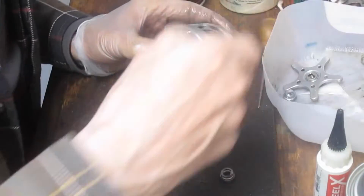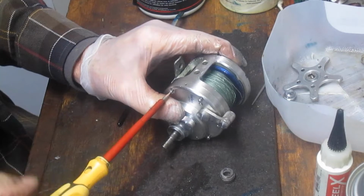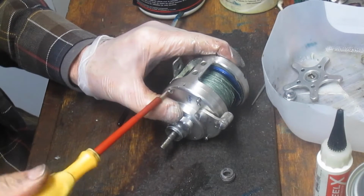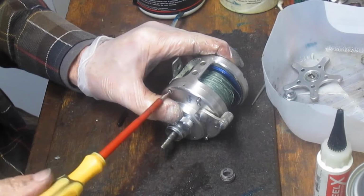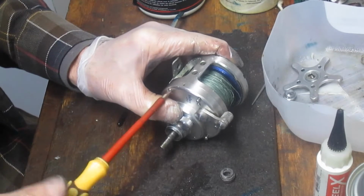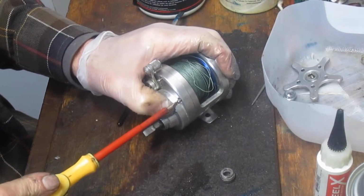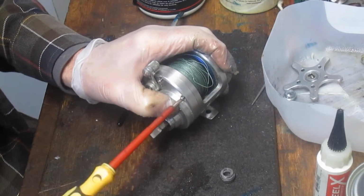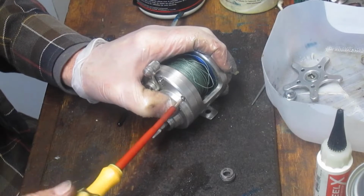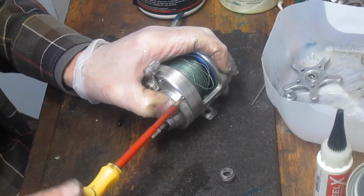And I'm holding tension on there because we have the springs in there, and that's going to shoot the case if we don't get that right. So go north, south, east, west on this. That'll hold the tension proper for these cases. If you go in a circular pattern, either clockwise or counterclockwise, you may have it bind. You don't want to do that.